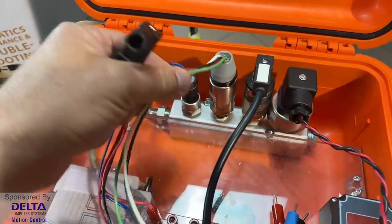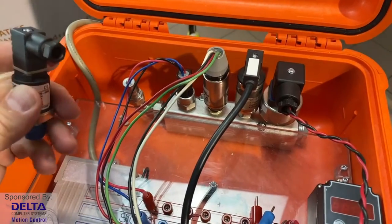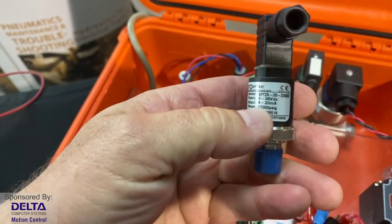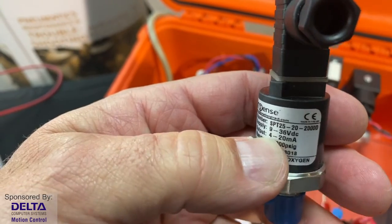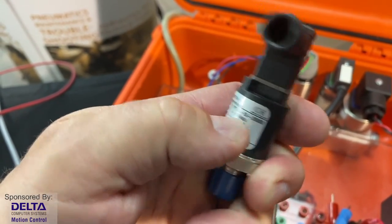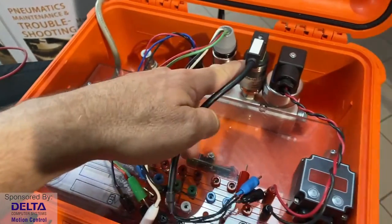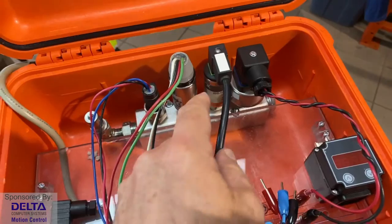No, in this case, these pressure transmitters are continuous reading and they're meant to keep track of the range. There are different types of connectors and what have you, but in all cases, it's about an analog signal. Very common for us is this particular one that I put on the spec sheets, and it sends out 4 to 20 milliamps for the range of pressure that is 0 to 2,000 psi. That's a ProSense pressure transmitter.